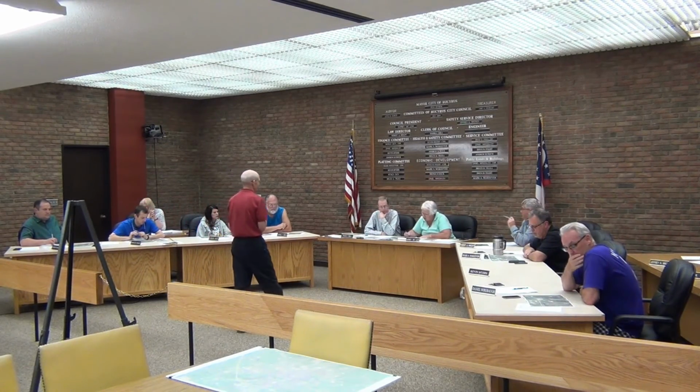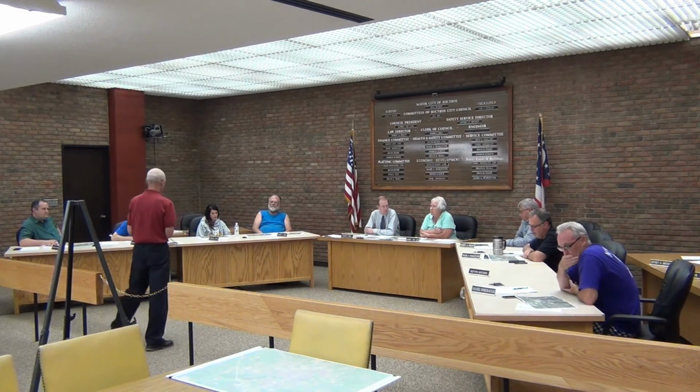Okay, so that piece is already installed. So it wouldn't take much to get from here over to the tower. But we don't really need to go directly to the tower. We can feed it into lines that are currently there. But they're all 6-inch lines on the street, except either Winger or Maple has a 12-inch. Yes, there's this one 12-inch right here. It goes to the tower. You made a statement that all that to the west of the railroad tracks is inadequate because of the 6-inch lines. That's an improvement over what you have, but it's not the full redundancy that we're talking about.